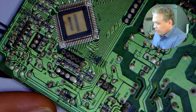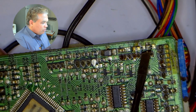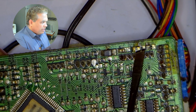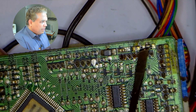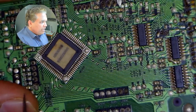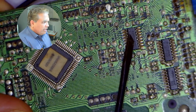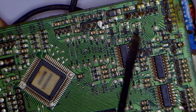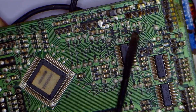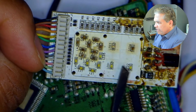If the microcontroller is not making the signal out, it is also a problem. I have studied this section of the circuit board — a couple of capacitors were mounted here and they have been removed from the circuit. I will solder a new capacitor here. Before that, I will check whether the microcontroller sends signals to this Darlington array. This Darlington array and these three transistors all together turn on the display, working in sequence to give us the numbers on the display.